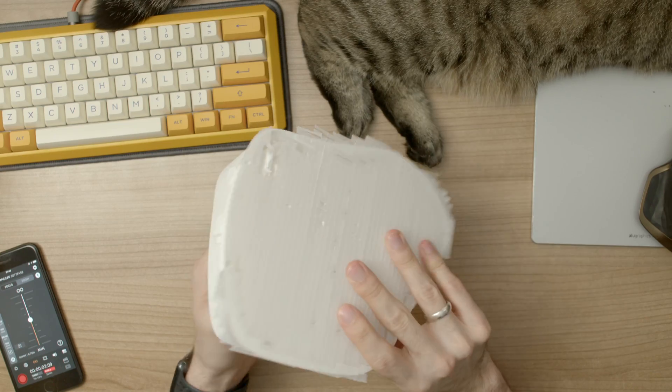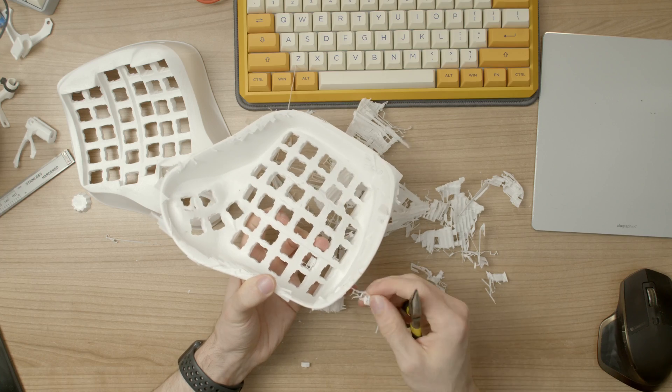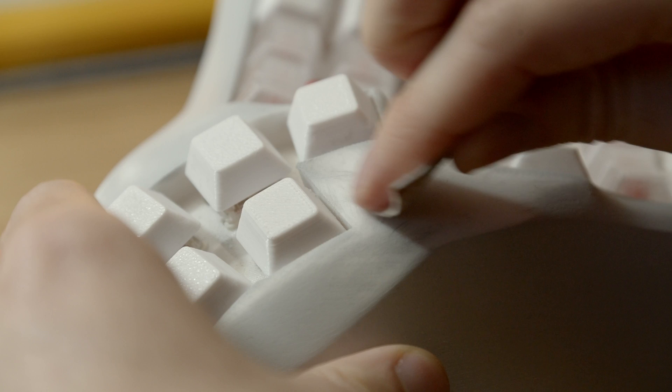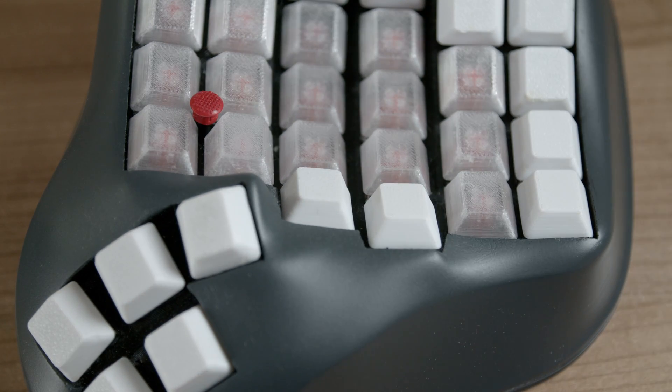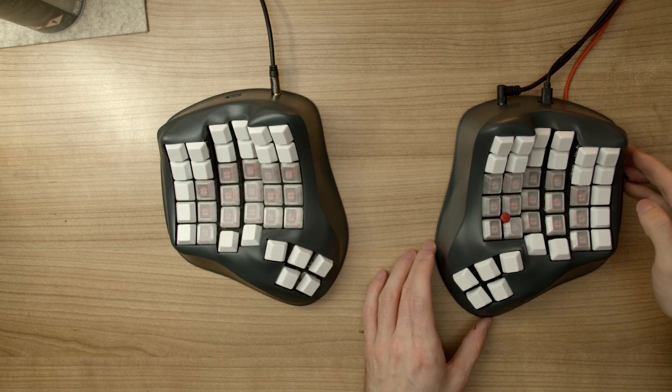Printing the keyboard halves was, as with all Dactyl-like keyboards, a lengthy process. Each half was printed in 25 hours, and mine are printed in white PETG because I wanted a more robust build. In the end I think this was a bit of overkill, as the more abrasion-resistant PETG took me about 18 hours to sand to a smooth finish. After some coats of primer and dark grey spray paint, there are still very slight layer lines visible on some sides. Overall I really like this case — it looks and feels really nice with a very smooth surface finish. I also painted the space in the keywell and the thumb cluster black with acrylic paint to give the keycaps more contrast. I modeled custom keycaps in Fusion 360 to have my own customizable keycaps. Source files and downloads are in the description and on my GitHub page.